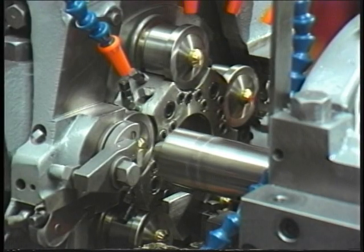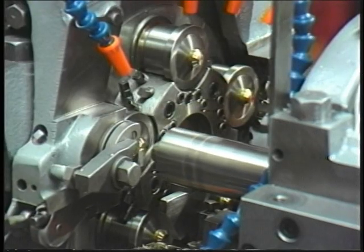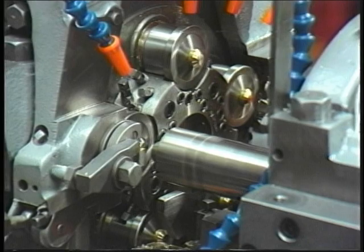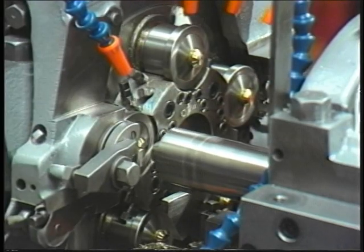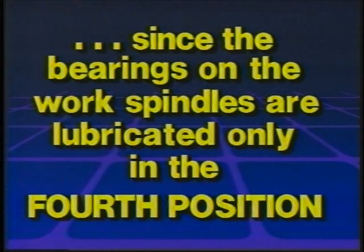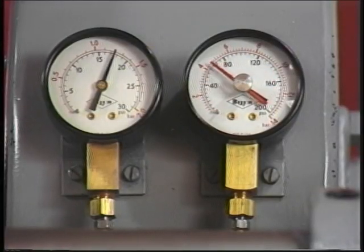Index the machine a minimum of five times so that the oil reaches the bearings on each work spindle, since the work spindles are lubricated only in the fourth position. Note: the machine should never be run for any length of time without cycling, since the bearings on the work spindles are lubricated only in the fourth position. Also check the high and low pressure gauges.